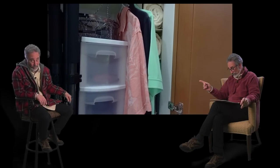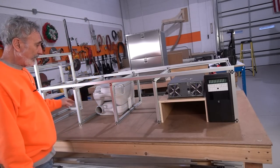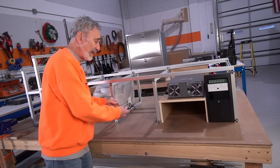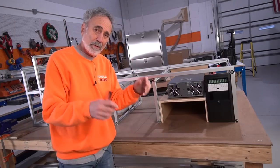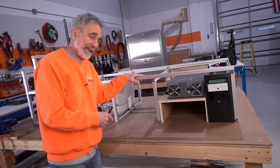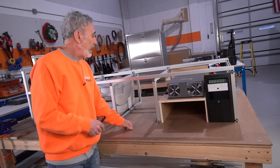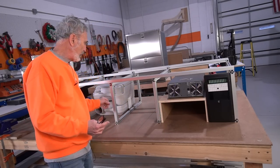Built-ins and storage - we're talking about options. When you look at built-ins, shelves, storage, cabinets, closets, make sure they're not too rigid and specific in their design. I'm not going to give you drawers in these bays - I'm going to give you baskets. You take the basket in the house, fill it with everything you want to take on your trip, come out, slide them in, and off you go. Much more efficient than drawers, and the drawer carcass itself takes up a lot of room. We want to be efficient in these little guys.